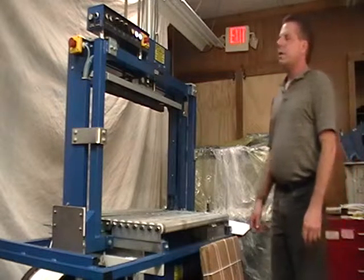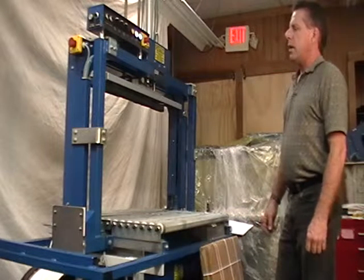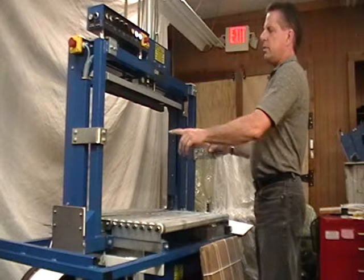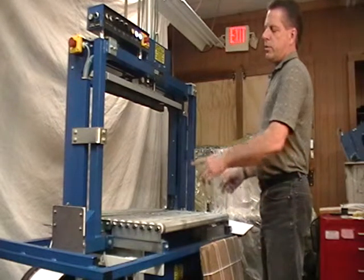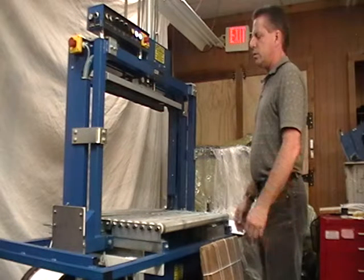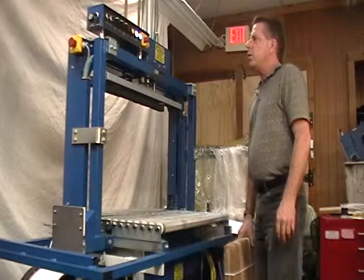You are viewing a Mosca TR3-C with a 900mm by 650mm arch. That's 36 inches wide by 25.5 inches tall. We have cut the corners on the guard that allows an extra 2.5 to 3 inches on the side, so it's actually about 39 inches of width. It allows us to get the maximum size bundle of corrugated through this machine.